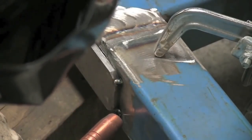Now this is one of those 1/4 inch pieces that I got from the James F. Lincoln Foundation. I had it in a box, and I just use it as a doubler. But you can see here, it would be hard to get a short stick out with that contact tip recessed back up in the nozzle. But when I trimmed it like this, now I can get a good stick out. I get more arc force, more punch on a fillet weld like this.